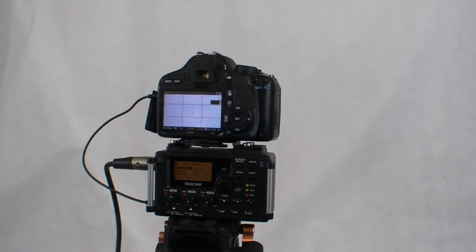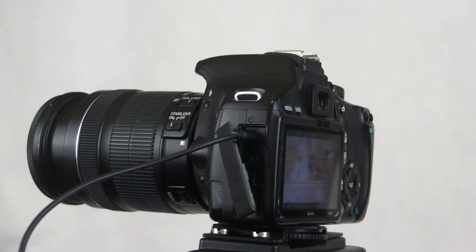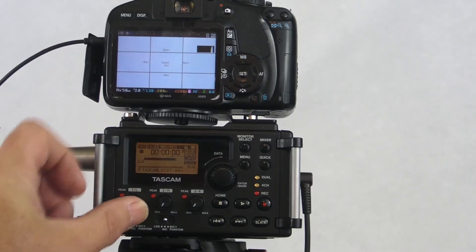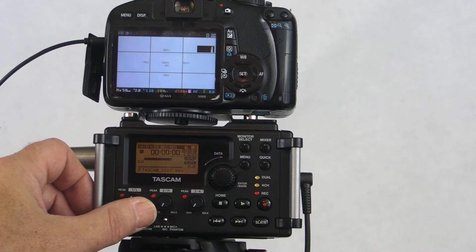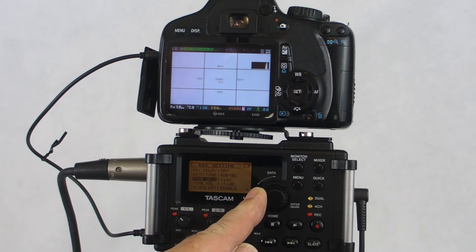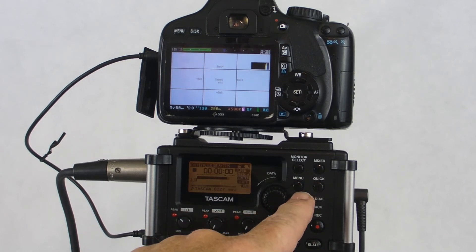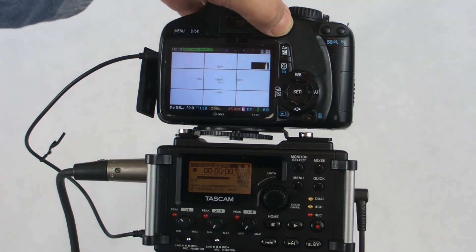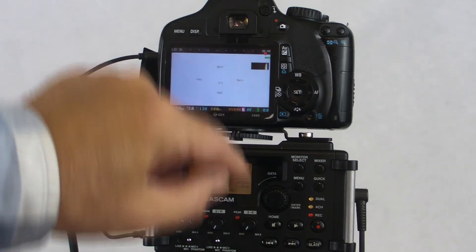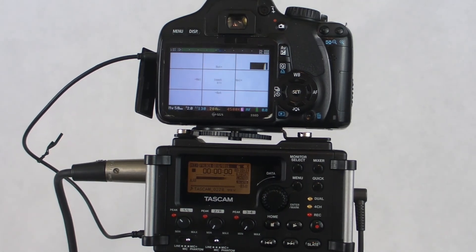It's got standard camera quarter-inch screws top and bottom, so it can go between the base of the camera and your tripod. Connect the Tascam's output to your camera's input — you'll need a short 3.5mm stereo lead. Set your levels up from the mic to the Tascam first, and then from the Tascam to the camera so you get all the levels matching. I've set the Tascam up to put a slate tone on when you start recording and when you stop recording, and that goes onto both the Tascam and the camera. This makes it very easy to sync the audio to the video in post-production. Put the camera into record and then hit record on the Tascam. In your editor, the top and tail slate tones make it very easy to sync the Tascam audio with the audio on your video.